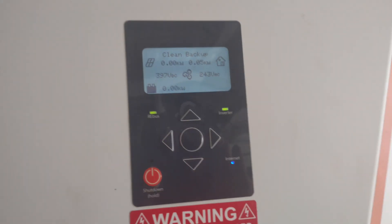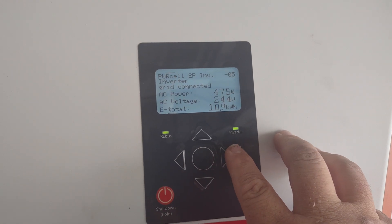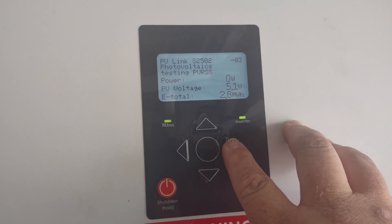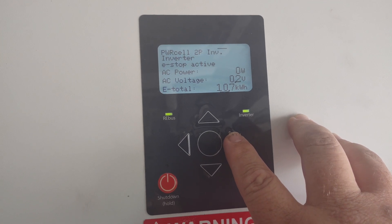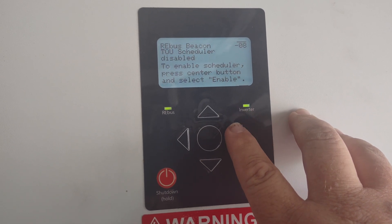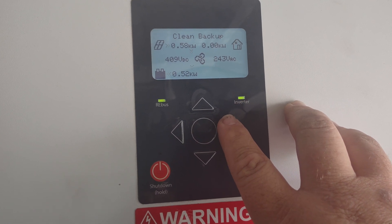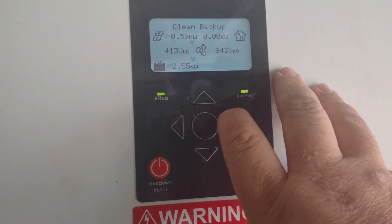We're going to go back to our main screen — we have all of our green lights and everything's come back up. We're now waiting for the inverter to completely kick on. Once it's doing that, we're going to scroll through and make sure every single one of these is making power. We're still testing this particular PV link. Check the next couple — still testing. Making sure we have our batteries all connected and input voltages are correct. Now we're starting to see some flow from the system — flow from the panels back down to the battery. And we're all connected to the grid. Everything's looking good.